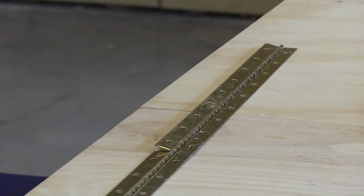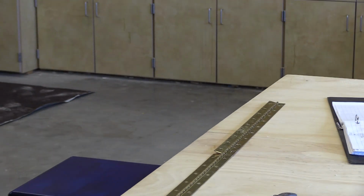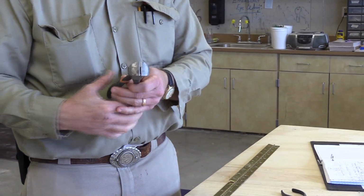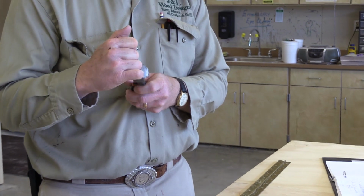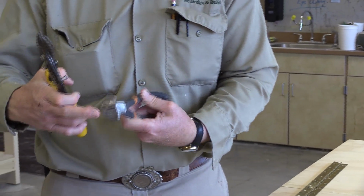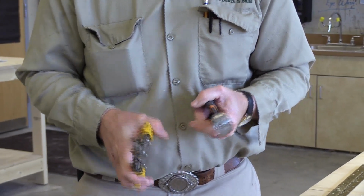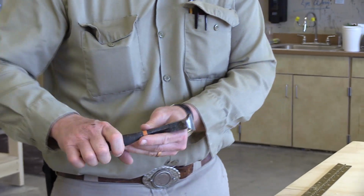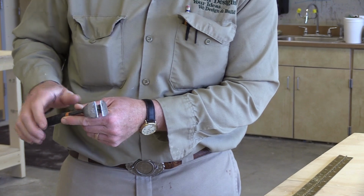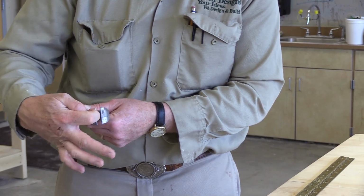Now I'm going to go over and see if I can find a wire cutter. There are all sorts of different types of wire cutters. I really like these, especially for this application, because the cutting force is all horizontal to your hand, whereas a side cutter is more like a tin snips, where it cuts in front. The cutting edge on this runs this way, and like this on that one. So if I put it on the end like this, just right on the edge, I get the same cutting force as I do over on this edge, all across that whole surface.